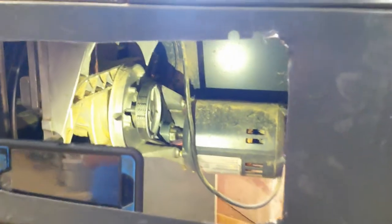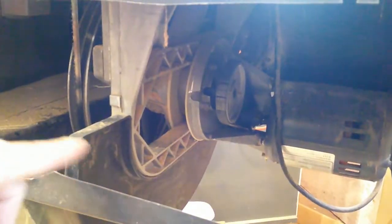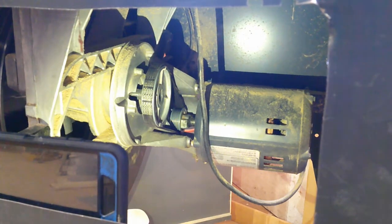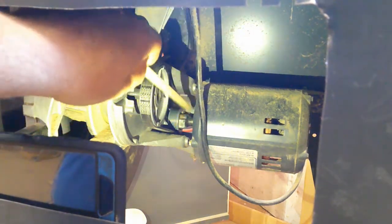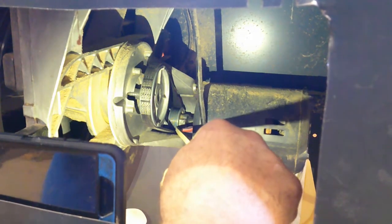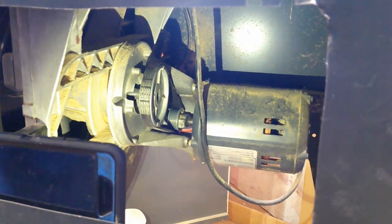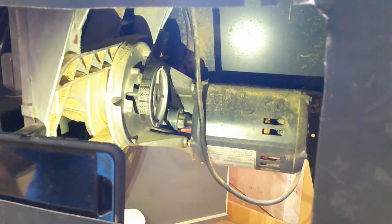What you're looking at here is a cutaway of my saw. You can see that I kind of butchered that cutting a hole in there because this has happened so many times it drives me crazy. It also has a handy dandy phone holder for a light. Right here is your drive belt. Down there is your drive pulley right there on the motor. These two continually get out of alignment, and it's usually the bottom one that's the issue. That pulley slides inward toward the motor, and when that happens it pops the drive belt off. That's why I butchered this thing — you can almost not get into the bottom side. There's a cross bar about right here that's in the way, but after opening this up it's much quicker.